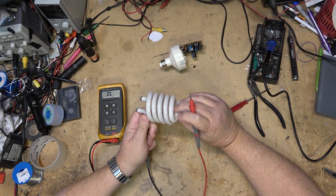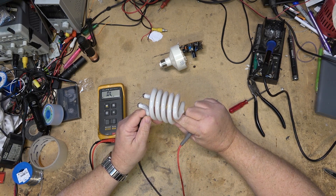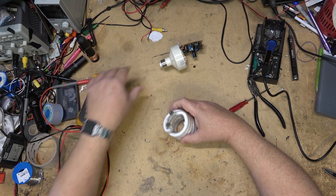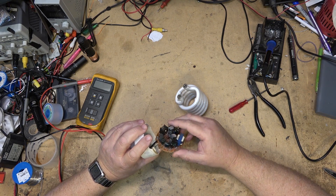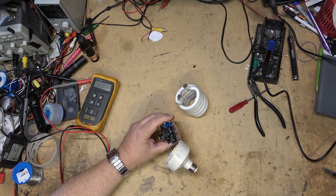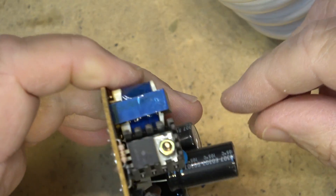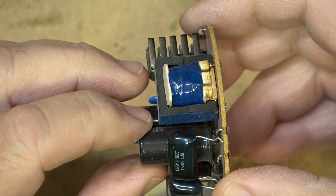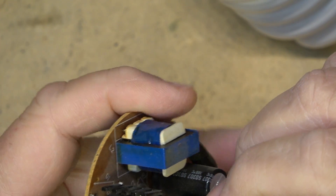That's still a very good run considering how long this lamp lasted. You can see the glass phosphor is actually darkening - it's so old. I'm amazed this lamp lasted the life that it did. Now we know this time it wasn't the inverter that failed, it was the actual burner itself. I'm surprised the capacitors have lasted as long as they have. Looking at the capacitors in this one, they actually used high-quality Rubycon electrolytic caps, and that is probably why this thing lasted all the years that it has.